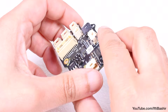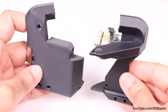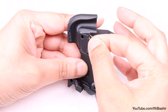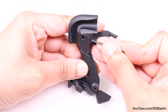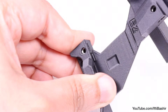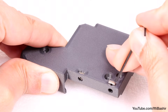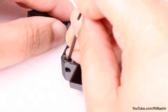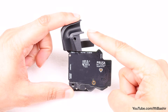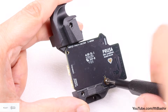Another smaller electronic board to mount next, referred to as the Prusa love board. Install this onto its plastic mount — locate the mount from the printed parts package along with its cover and the main love board cable from the electronics and fasteners package. Insert an M3 square nut into the small gap beside the 90-degree channel, then a second on the opposite end. Move to the printhead cover and insert two further M3 square nuts on the back side and a final one on the inner side. Seat the love board into its mount with the channel up top, text facing you, and secure with a single M3 by 8 screw, taking care not to over-tighten.